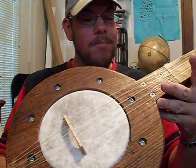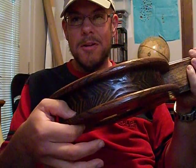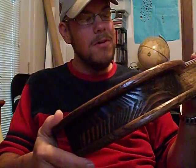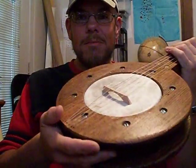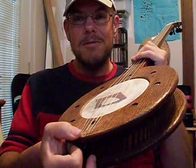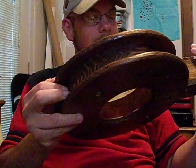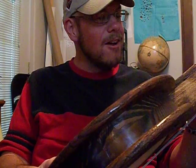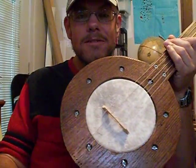I plan on building another one. Next time I build, I'm going to try to make the body with a three-quarter-inch thick top, three-quarter-inch thick bottom, and the middle part three-quarter-inch thick. I got some more wooden bowls from Goodwill — I bought three of them — and I'm going to use one for a tone ring. I've built two of these with quarter-inch thick tops and they always crack right here when you tension them down, so I don't see any reason why you can't build with a three-quarter-inch thick top. I've got some other projects on the fire right now, so that one's on the back burner, but I'll make sure to put a video up whenever I get it done. Thanks for watching and stay tuned.